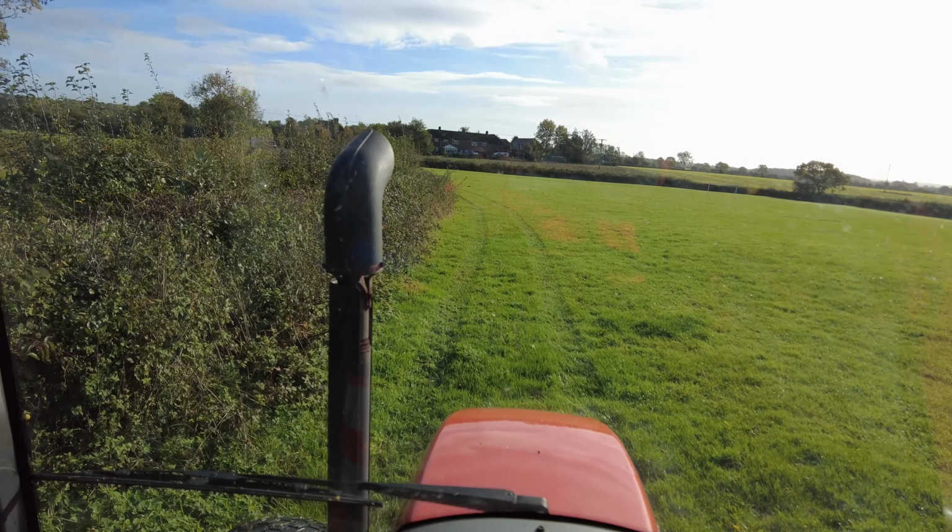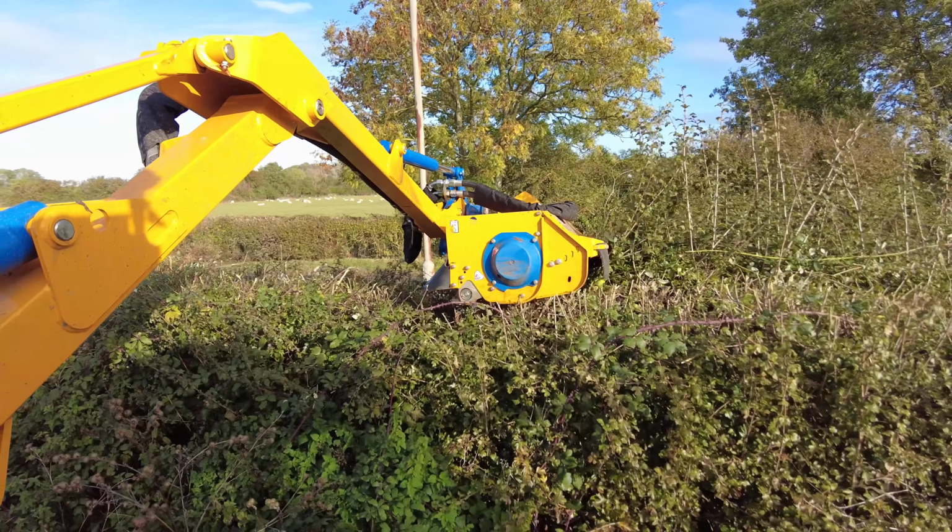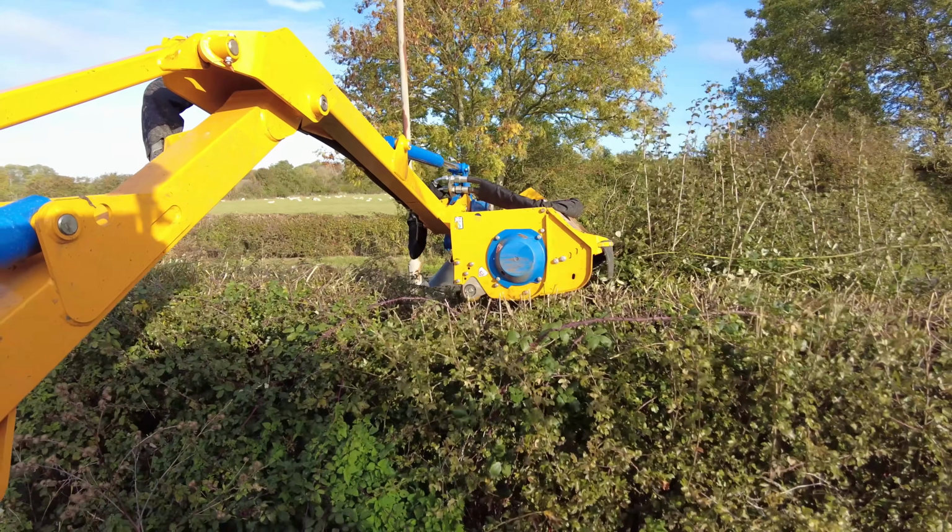Now once I've done the whole perimeter, I can now come in for a second pass to try and take the height just a little bit further, and I just keep trimming it back, leveling it off to the last bit I cut to. So now that the tops are all done, I've done about 3 passes just to ensure that I've done the full width, and now I've just gone along and done around a 45-degree chamfer, and now I've got to do the sides.